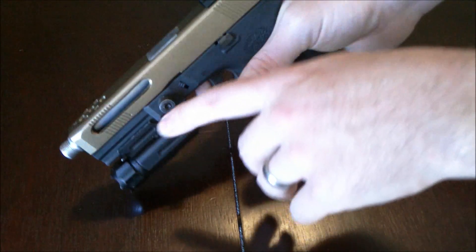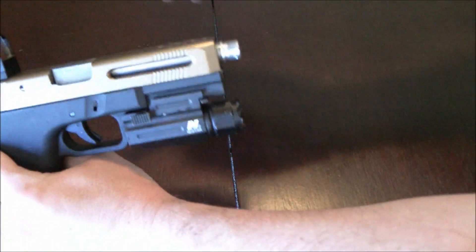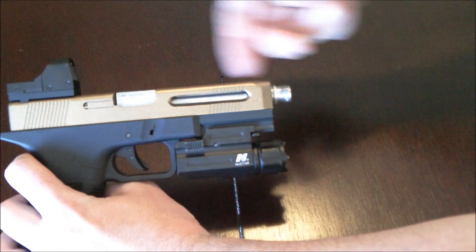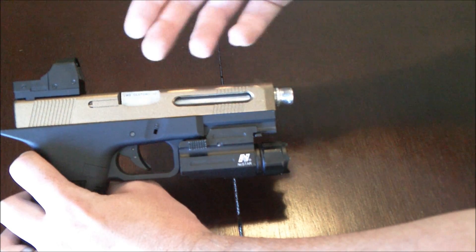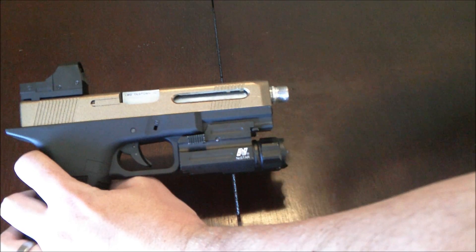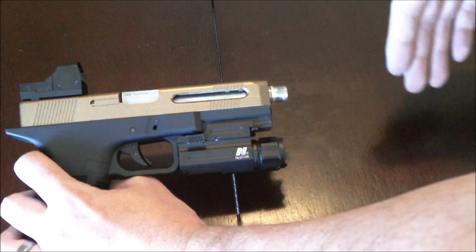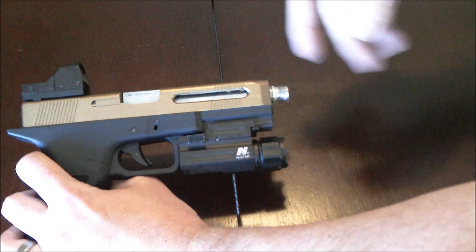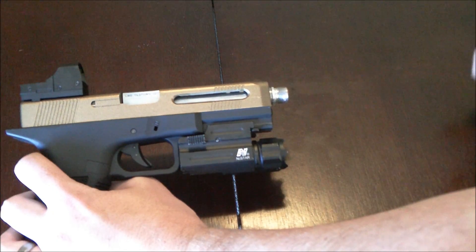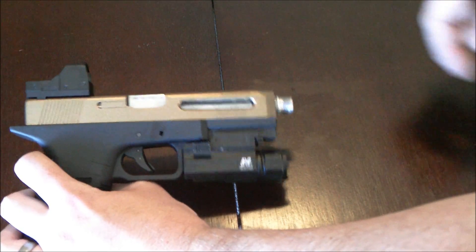With the slide, what we ended up doing — first off, I took out the standard stock outer barrel and I polished it. First with a wire wheel and then some 320 grit, 400 grit, 600 grit and then some Mother's Mag and aluminum polish. It gives it a nice kind of satin brushed finish. Make sure you always do it in the same direction.